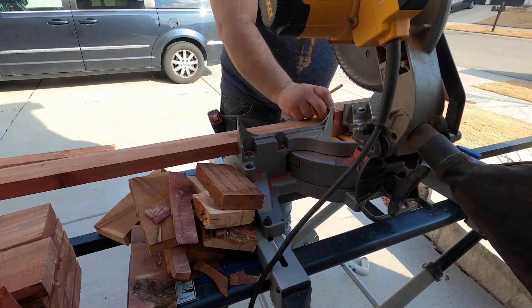Now it's time to put the boxes together. I built my boxes at about 13 inches high, which is pretty close to the minimum that you want for raised beds. You can definitely make them taller, which may be easier on your back, but just keep in mind that the taller they are, the more wood and soil you'll need, and that equals money. Each of my planter boxes will be about eight feet wide and around two and a half feet deep — any deeper than that and I wouldn't be able to reach the back. I'm pre-drilling all of my holes because pilot holes are a must for softwoods that have a tendency to crack. The screws I'm using are outdoor decking screws, and the length you'll need will vary depending on how thick your wood is. I found that it really helped to clamp everything together tightly as I screwed it all in.